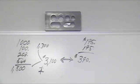The DMC cutter will help you realize other savings as well. For example, less tool changes will reduce wear and tear on your machines, less spindle starts and stops, less table and ball screws wrapping back and forth. You'll have less programming time, less setup time, and free up tool storage capacity.